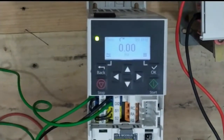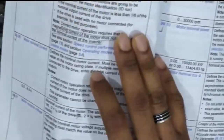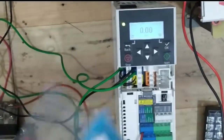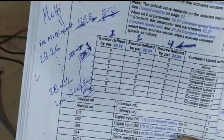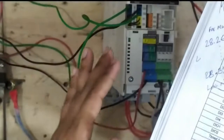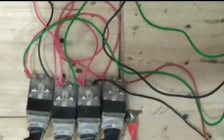This security is involved for process protection. Regarding jog mode: an important thing — when you select scalar mode, you cannot select jog mode; jog mode only works in vector (multi) mode. When our VFD is running in scalar mode, you cannot select jog mode. For multi-step mode, parameter group 22 (22.22 to 22.26) includes all kinds of parameters for multi-step sections.